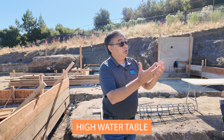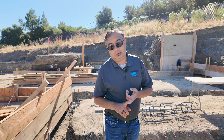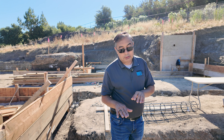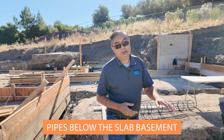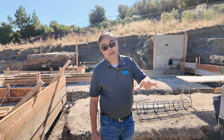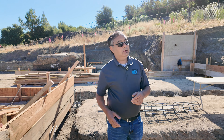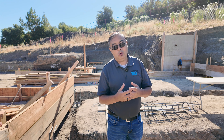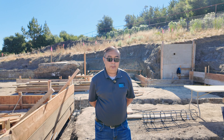On top of all that, when you dig so much into the ground you often have issues with water — either a high water table or water coming from the top of the mountain and collecting somewhere. A project like this has a lot of drainage work. We have three different levels of drainage pipes: one set below the basement slab so water never rises to the foundation, a second layer so water doesn't come through the surrounding basement walls, and a third layer that takes roof drain water away from the property.